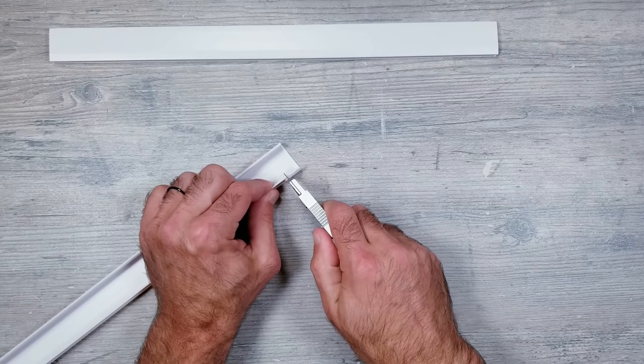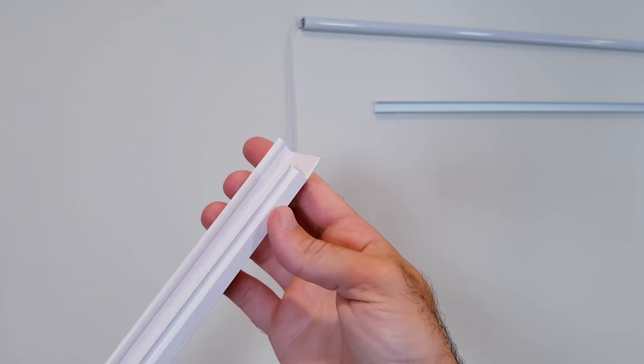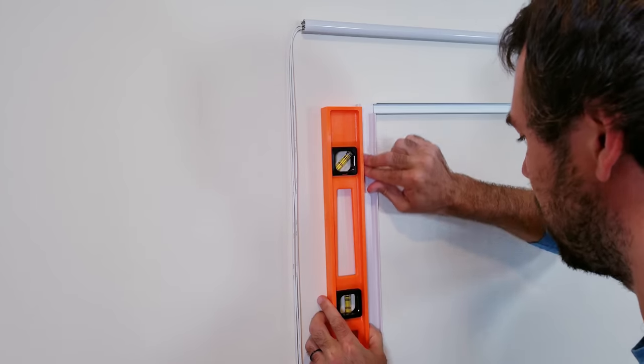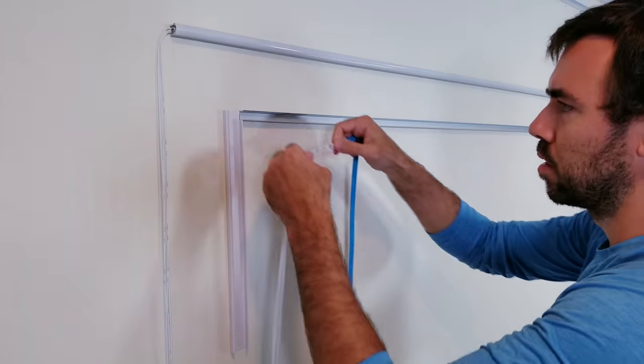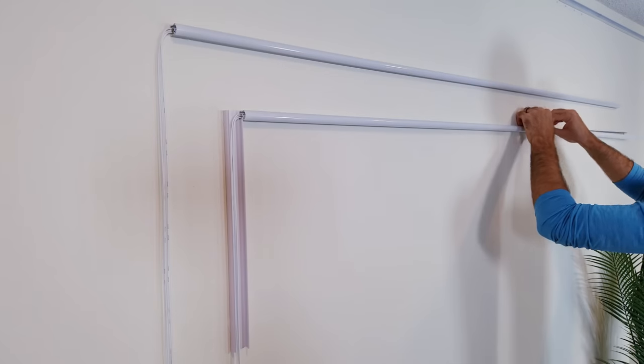What I found works pretty well with these is to take a knife or scissors and cut off a small piece from one of the sides on the bottom track. I'll then go back to the diffuser channel and, using either some removable 3M sticky pads or screws, secure the track that we just cut as close to the profile as possible. I'll go ahead and install the LED strip into our channel, and once complete, I'll pop on the diffuser cover.